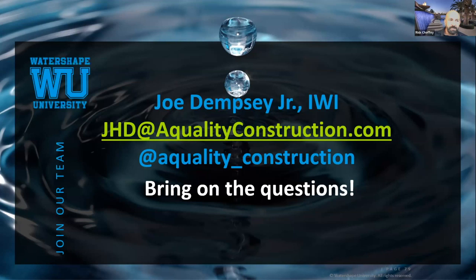Absolutely. Somebody else got a question too: when that floor is up, what kind of railing systems are you doing for the fall protection around the perimeter of that negative edge side of that pool? We have less than 30 inches everywhere except for the catch basin, and we have a temporary grating system in there, but there will be a raised grating system that's taller with some Mexican beach pebble over it. So there will be less than 30 inches everywhere. So you're keeping it within your fall protection range, or it ends up in landscape.